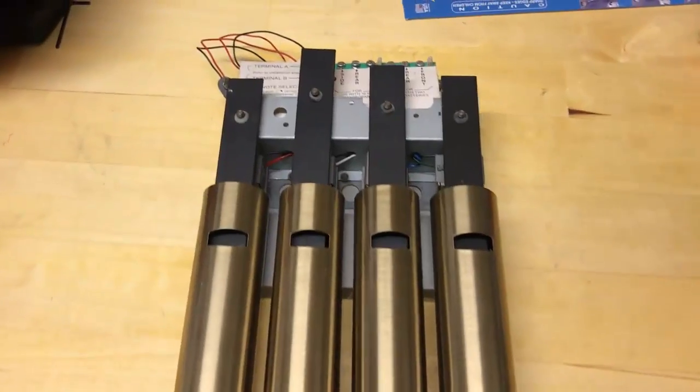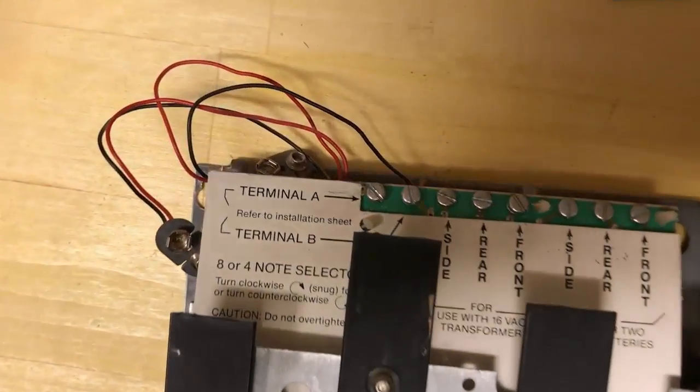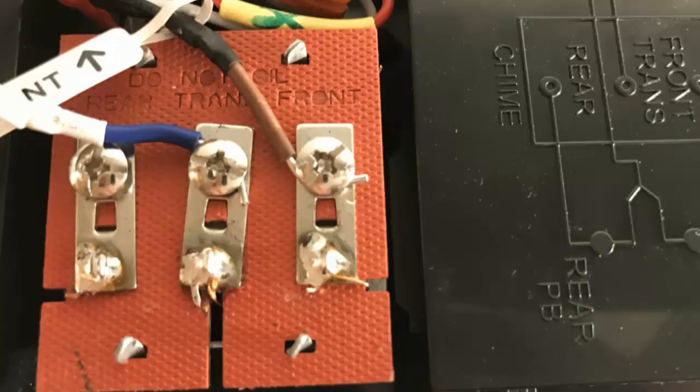Now, this next part is very important. The Ring Pro is only compatible with digital chimes or mechanical bells. If you have an older mechanical chime, pay close attention. This doorbell will only work in situations where the doorbell switch completes the circuit from the transformer to the chime. To figure this out, you'll need to look at your doorbell chime. If you see a layout with 2 wires clearly labeled transformer and front, then you should be in the clear.